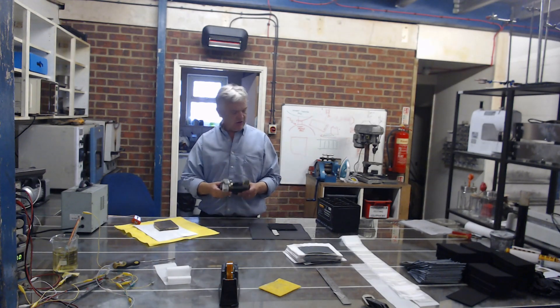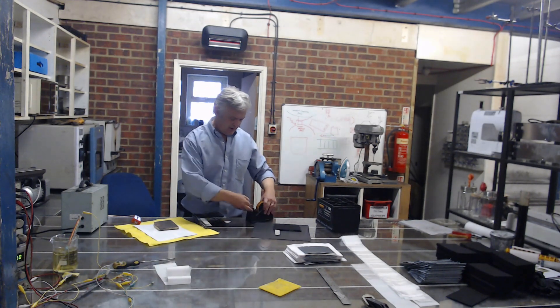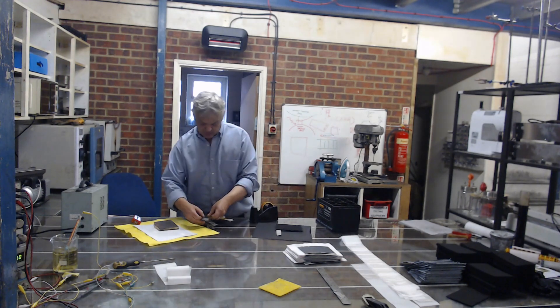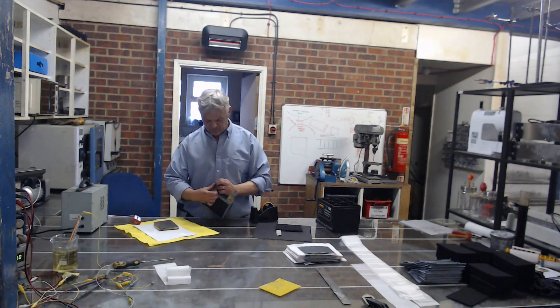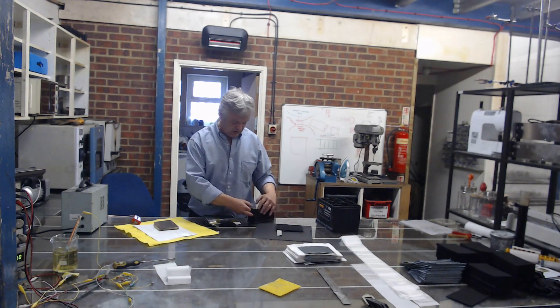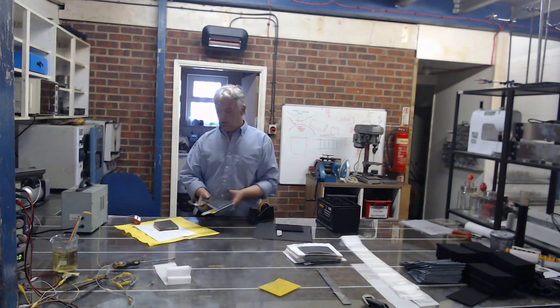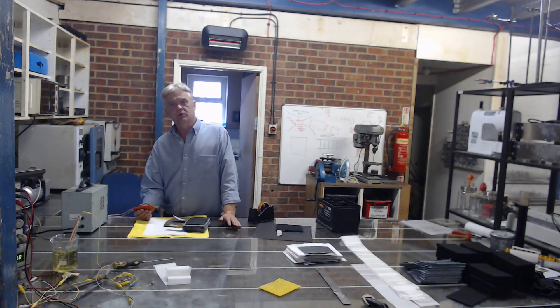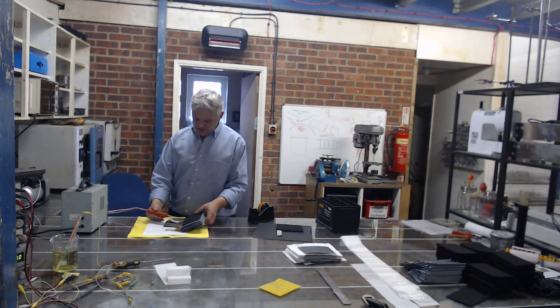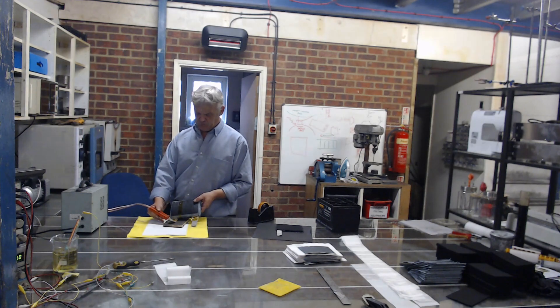What I do actually is once it's all together and gathered, we need to make sure that all these tabs touch and are in line. I put a little bit of kapton tape around there just to hold everything in line — a little bit of kapton tape around those protection HDPE lugs that we put — just keep everything together, make it quite nice and neat, makes it all a lot easier to do. So a bit of kapton on there holds that together, and it's as simple as popping it on something like a stone. Because it will burn through — pop it on paper it'll burn, pop it on the desk it'll burn your desk. The little bit of stone is non-conductive. Set the power, hold the little probes in place, and press the foot pedal — and that's it.